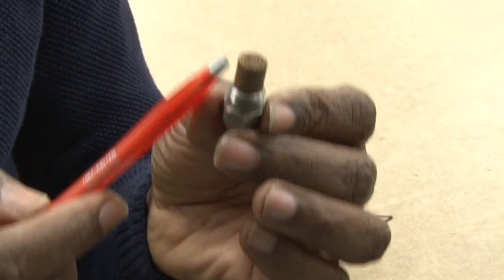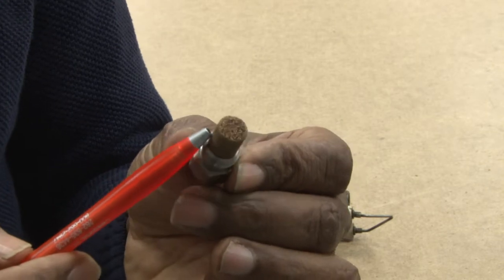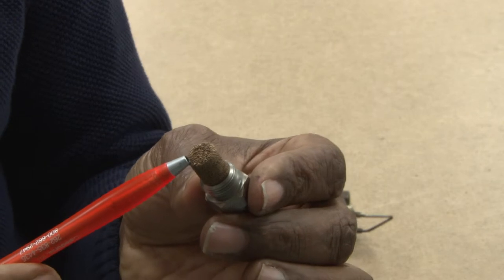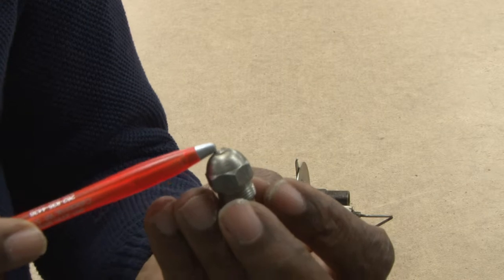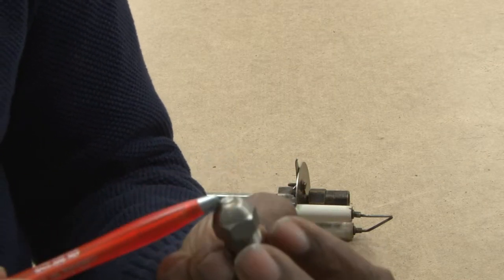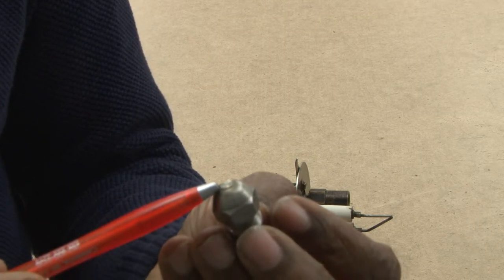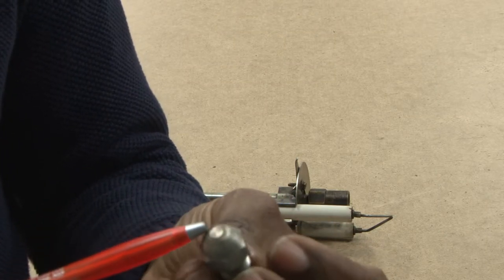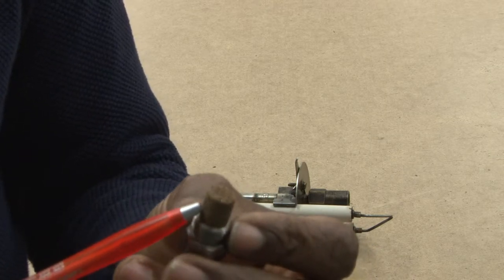Another part of the nozzle has a filter. It's made out of metal, usually bronze, and it's designed to filter out large particles because the end where it sprays the mist of oil is very small — smaller than sometimes the head of a needle. Because it's under 100 pounds of pressure, it would be like a spray coming out of it, but it's a very small opening. So they filter the oil before it even gets to the nozzle.